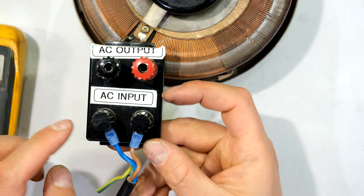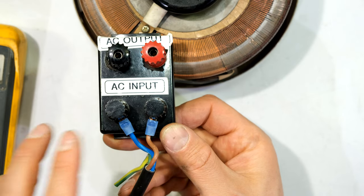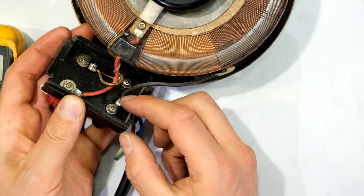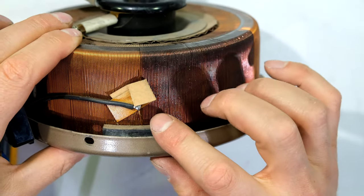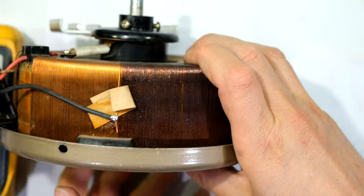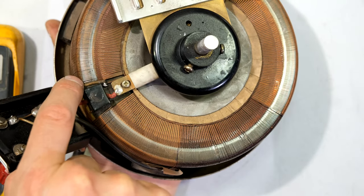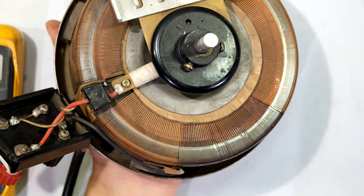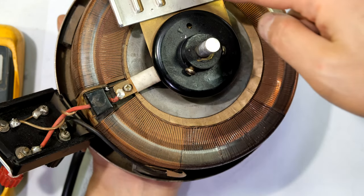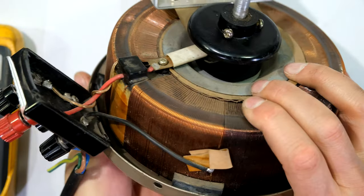On the variac it's exactly like that. My 226 volts is inputted between these two terminals, which I was measuring with this small meter. Let's follow this live wire — this black wire over here — turning this sideways, there it is soldered onto the winding. It's not at the beginning or the end of the winding. This is the beginning of the winding and this is the end of the winding, so this winding starts here, goes all the way around, and ends over there.